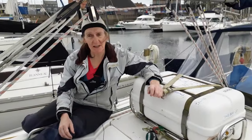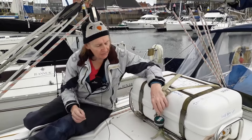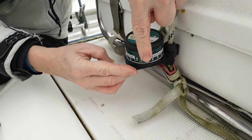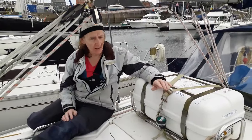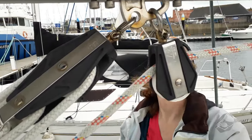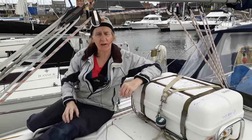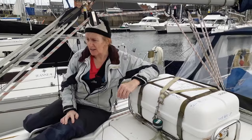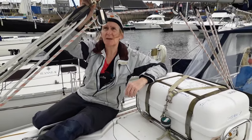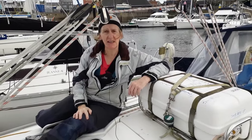Another little issue we've come across — two, actually. One is our life raft emergency hook, our hydrostatic release, which had released. Another problem is it's now out of date and needs replacing. Also, while I've been here, we've noticed that the seizings on the shackles are looking a bit crusty — they've been on there for quite a few years. When the weather's a bit better, I'll cut these off and reseize them. I think I'll just do every shackle on the boat, because under vibration they can work loose. One of my inspection items is to look at all these shackles, make sure none are deformed or cracked, and see if any seizings have gone.